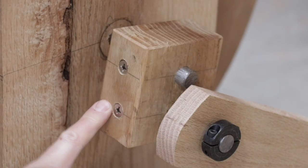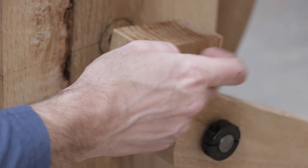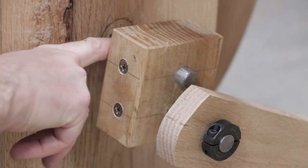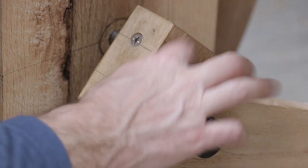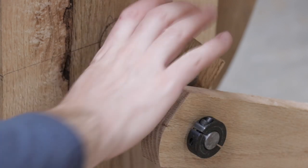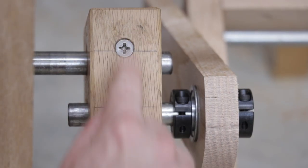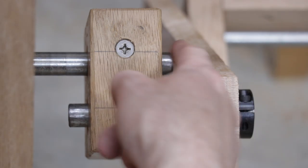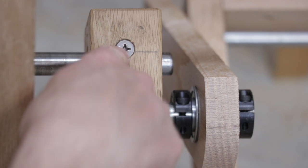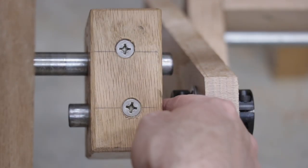The first thing I did was dimension an offset block of solid oak and drill two five-eighths-of-an-inch holes in the block to house the axle. There is a one-and-a-half-inch offset between the two axles allowing the actual mechanism to function. I also drilled holes for the axle rods in the offset block, put two threaded inserts in each hole, and then put a screw into each hole — the screw actually goes into each of the axles to keep them from spinning.